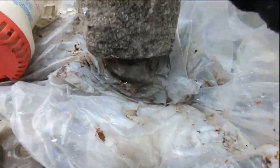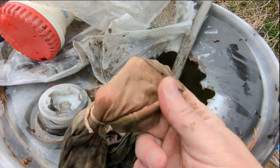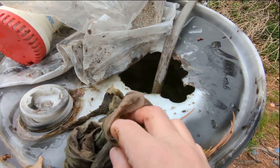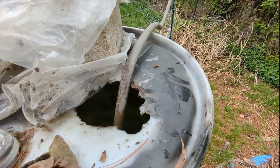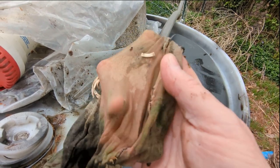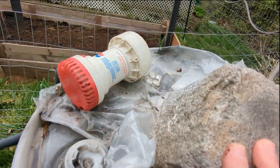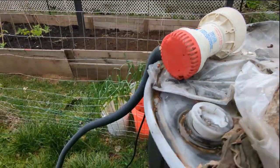I have the top of the barrel cut out, and you can see my hose coming in. All that green you see is algae — that's okay. If algae is growing inside, that's perfectly fine. Once in a while when the barrel empties and we have no rain, I'll take a hose and get out as much algae as I can. At the end of my hose I'll usually put a stocking secured with a rubber band to filter out any large particles. I keep the barrel pretty much closed — I put a piece of plastic over the top and a stone on top of it, which keeps dirt out without impeding water flow.